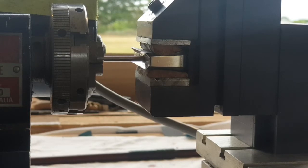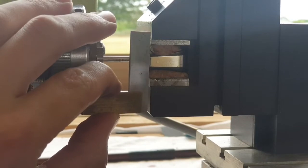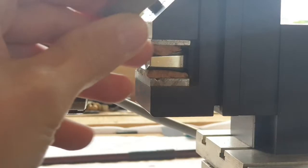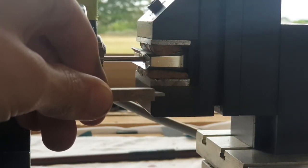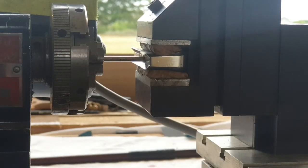If I need to rebush it and redrill it again, and set it differently, on the very rare occasions you may have to do that. But at this point, I've got that now set so that we are square and true this way, and on that facet. So there's three dimensions that it needs to be lined up square. And we're really ready to drill.